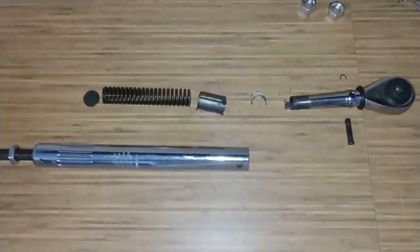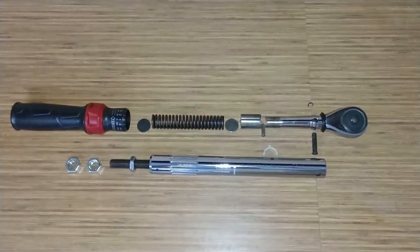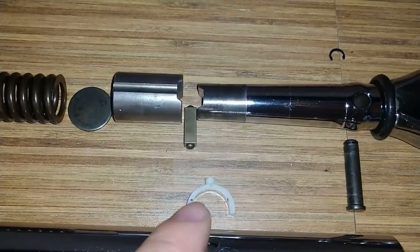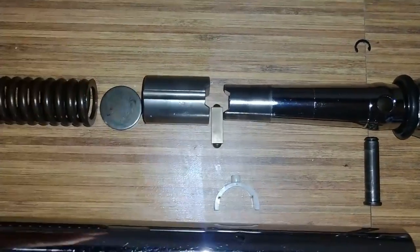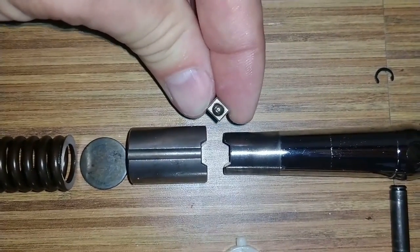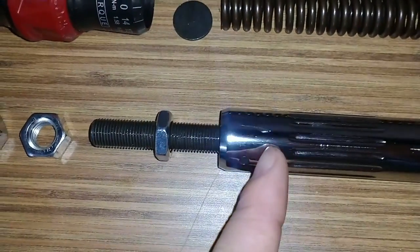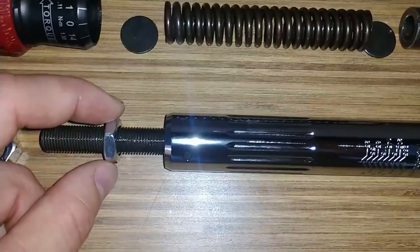I'm going to get it all cleaned up and see if anything was installed improperly. Here the Craftsman torque wrench is completely disassembled. It's got the main wrench body at the top, the C-clip, the drive pin. Behind that is the plastic ring that sits in the little hole on the inside. You've got the little rectangular tang that fits between the grooves — when you hit the torque, it'll twist, allowing the body to come down and hit the outer part. Then there's a washer separating the spring, another washer against the bottom, and this is the calibration that threads in and out for adjustment.